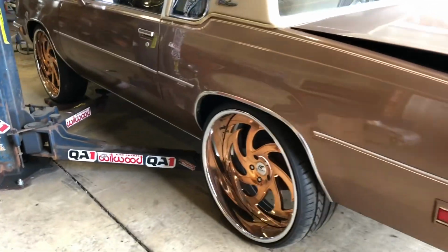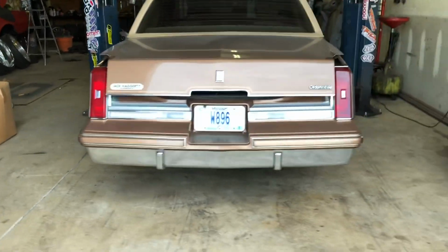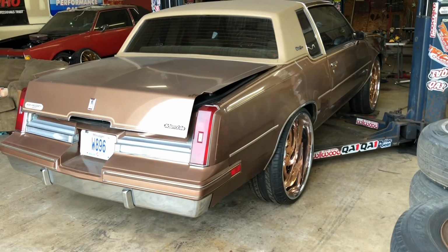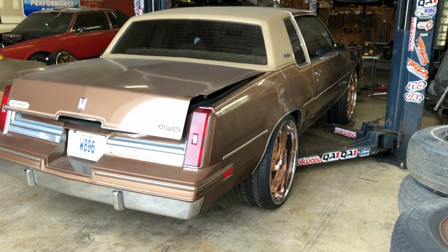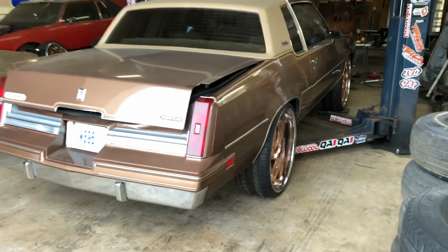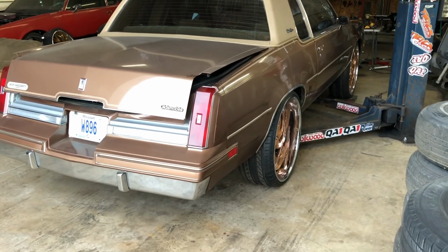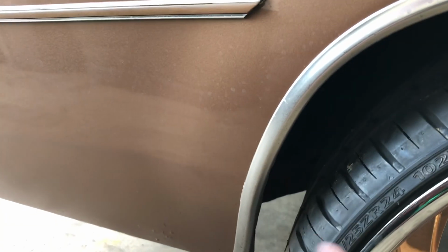Like I said, I haven't touched the back yet. The back, I'm figuring out I'm just gonna narrow it probably 1.5 to 2 inches. The car will be getting a 7-inch lip. This is a 5.5 inch, 6 inch, whatever. So the difference, boom. So the wheel will end up sitting just maybe a 1/2 inch under more, but it will have clearance. This car is not getting tubbed, and this car may get just the rear quarter frame rail notch, which when I say quarter frame rail notch, that means just that back corner inside there, just a very little bit. Does not need a full notch.